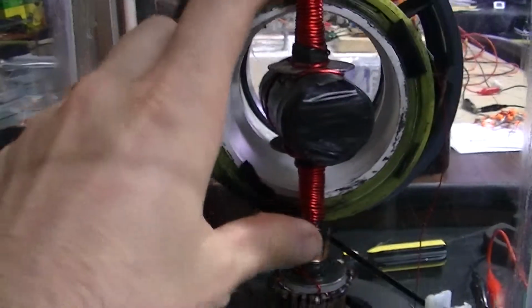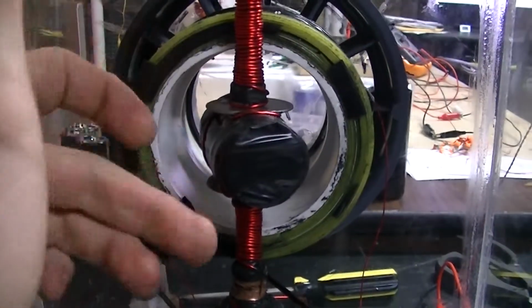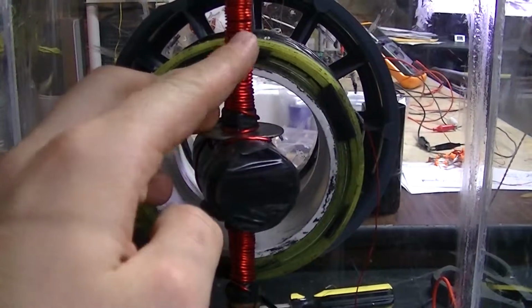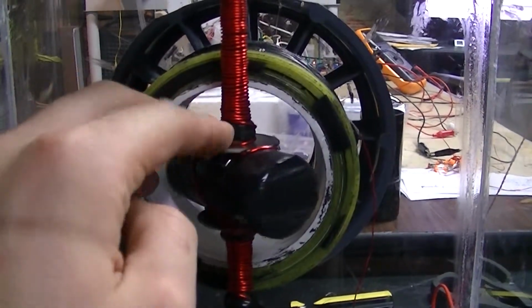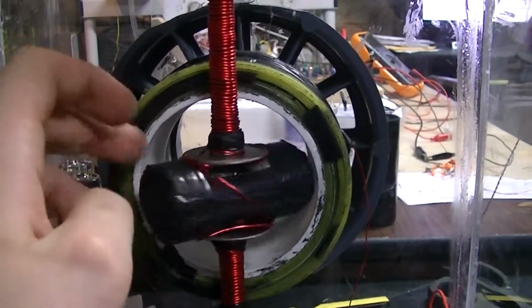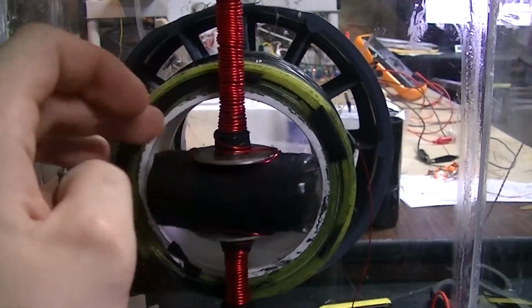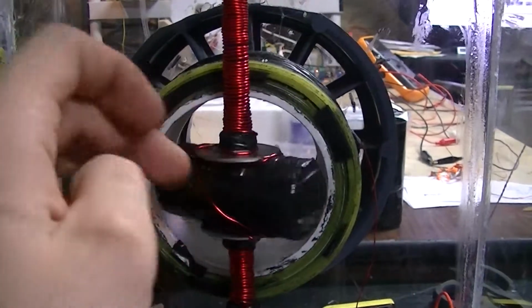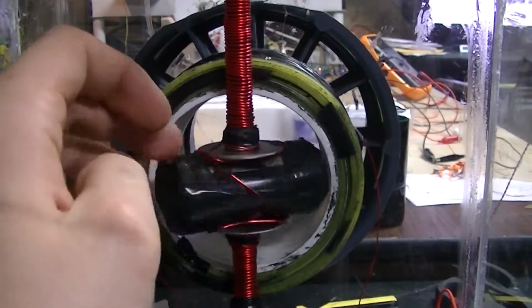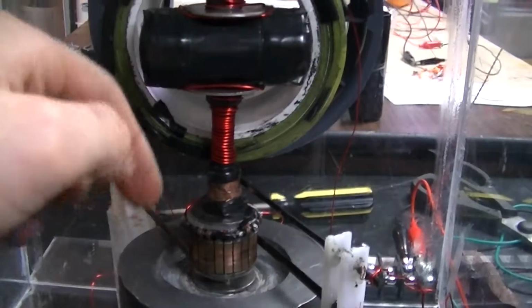But I was hoping to up the voltage a little bit, like a transformer, but I think it's actually doing me more harm than good. I was thinking it would either increase the magnetic flux of the actual interior part, or maybe add a little current to the back end and induce a little current, but it does neither. Instead, it's just impeding it. If I run it backwards, it seems like it's stronger, but I didn't set up the motor to run that way. It'll actually strip the brushes.